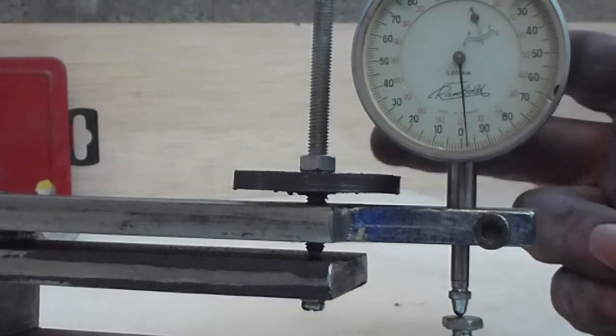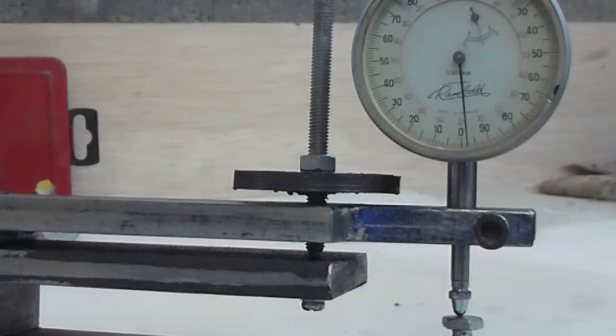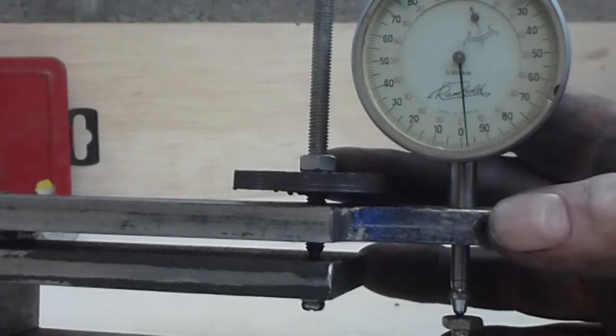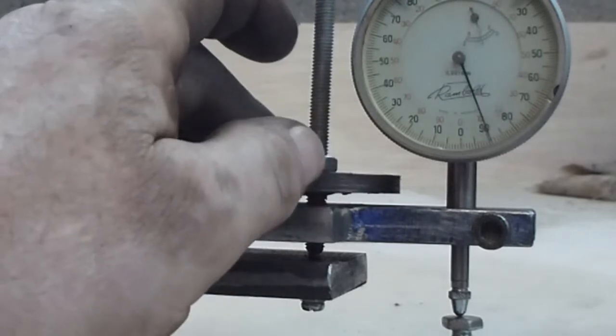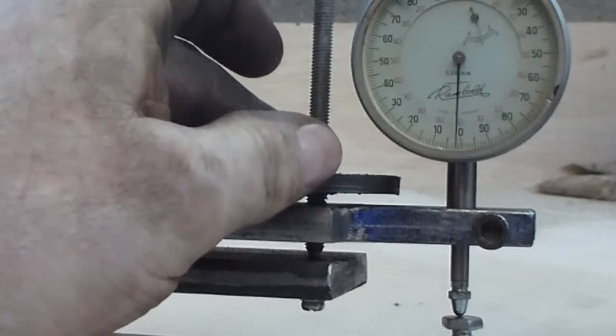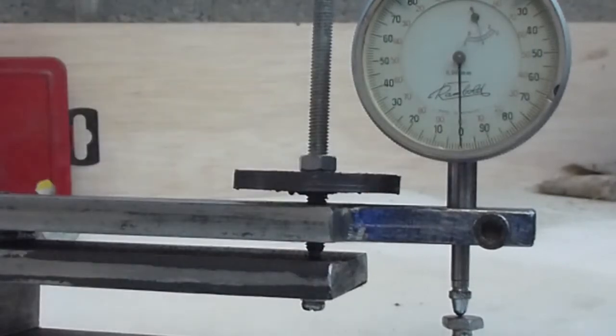So I went back to the 6mm with 4mm under here. The 4mm is 4mm by 0.75, which means that 4mm is the maximum inside the 6, which is 6 by a millimeter. So between the 4 and the 6, there's actually 0.5 millimeter per side, which becomes usable. The adjustment, although I still haven't made the flexion part, is extremely nice. So when I cut the flexion, I think it's going to be better.